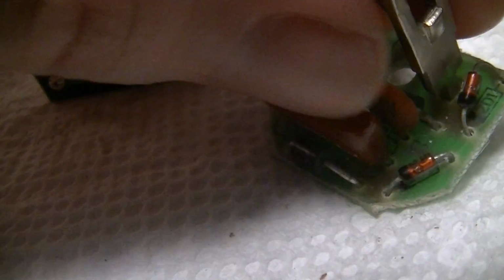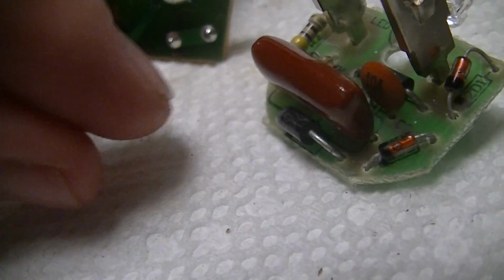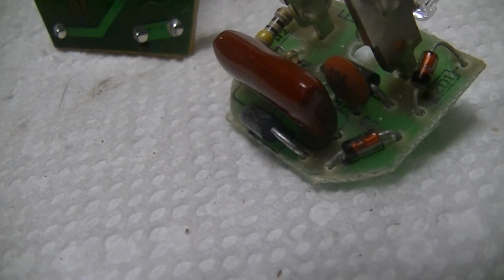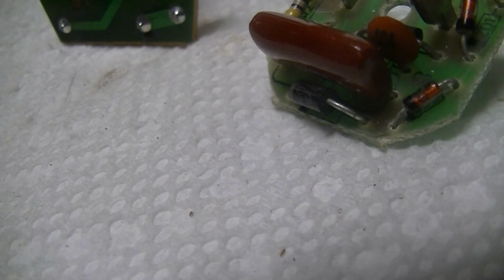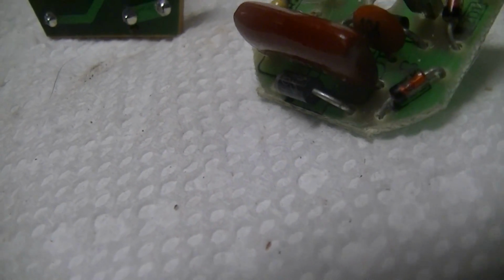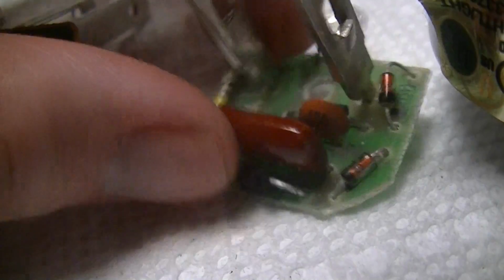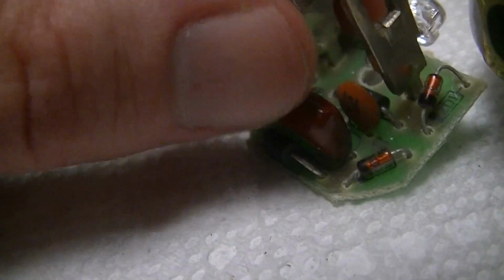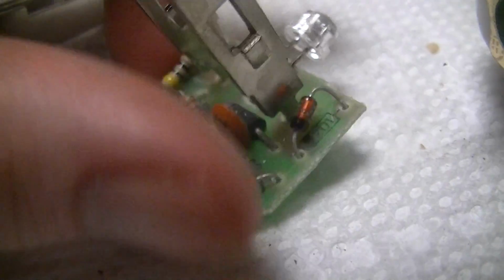All your harmonic content, because the capacitive reactance is inversely proportional to frequency. For the third harmonic, 180 cycles per second here in 120 volt mains land, the capacitor is only going to have reactance 1/3 of normal, 5th harmonic, 1/5 normal, etc. And given the very high harmonic content that is present on those, especially the square wave and modified square wave inverters, it means greatly excess LED current, premature failure. Also, it isn't good for the cap and all the various other ancillary stuff.